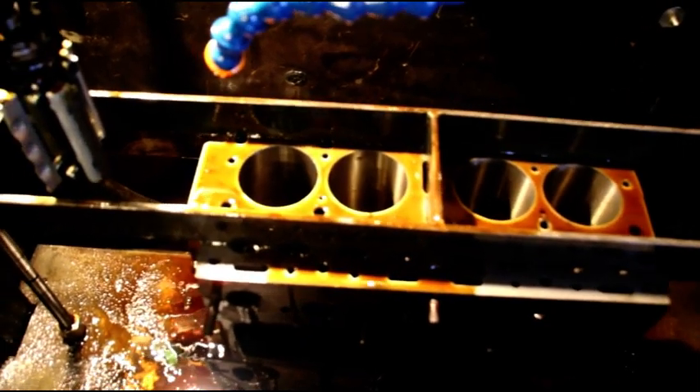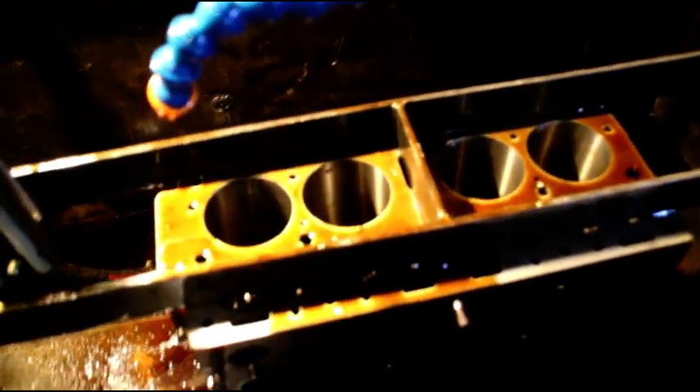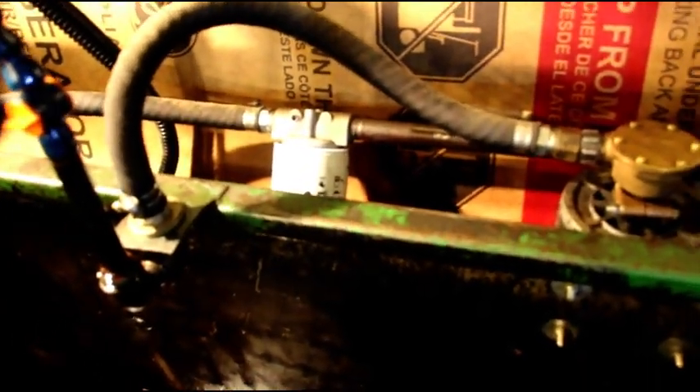Travis, you are in the honing tank. I have you within about one and a half to two thousandths on all the cylinders with the rough stones. We will start fitting the standard pistons next. I'm going to switch over to the fine stones - those guys hanging right there. I also need to change the filter because the oil is coming out a little too slow. Usually I get about one engine per filter, but it keeps the oil super clean and I can go a long time between changes. Time to change the filter.